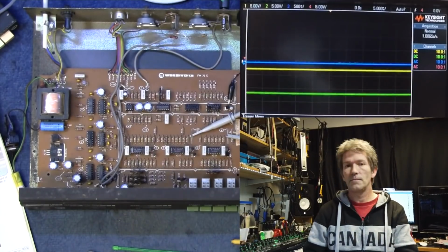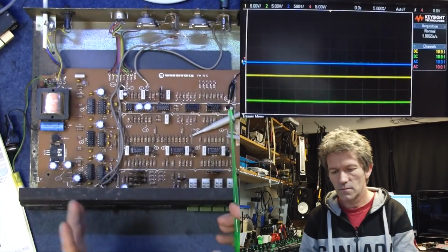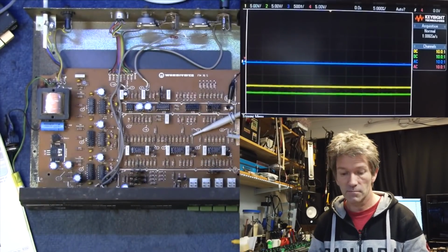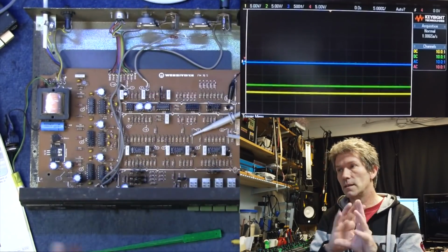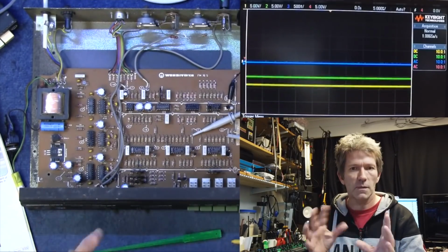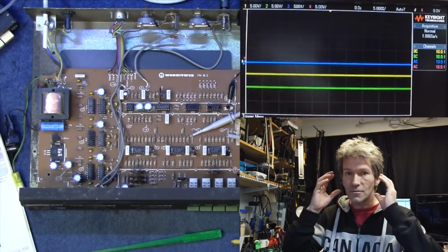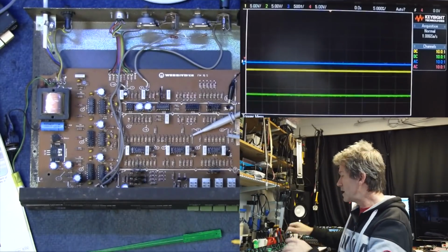Yeah, there you go. So I just thought I would try and explain what happens in one of these nice old vintage audio type boards. And that's it, basically. 3 Bucket Brigade devices, all at slightly different modulations. The clocking speeds are slightly different on them all. Send the signal into those 3, mix them together and bring them out the other side, and you suddenly get this nice big lush sound. I think it's a lush sound anyway.